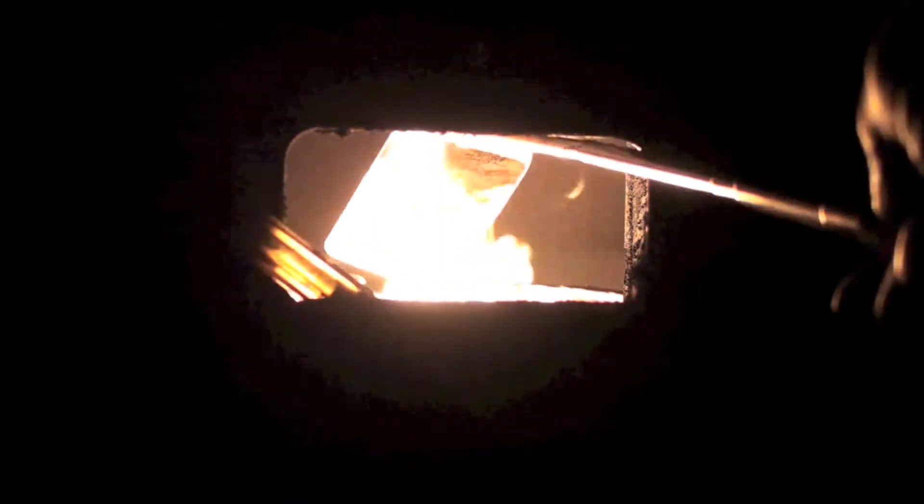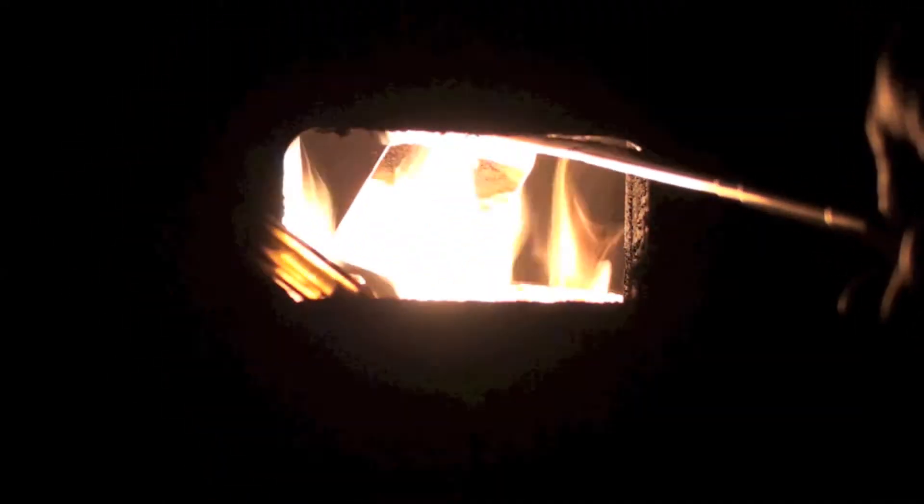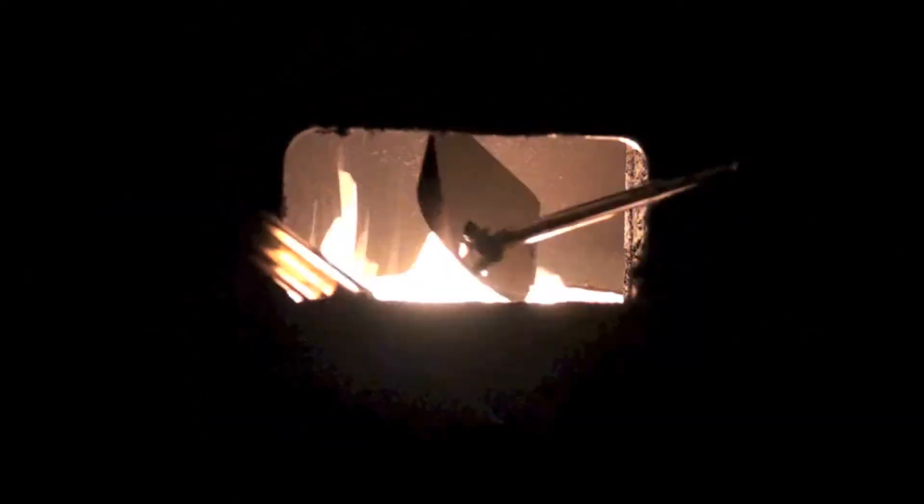When you're putting a flame mirror in like this, you're looking back and you can kind of see where the fire is coming from. Do not leave it in there more than about ten seconds — if you leave it in any longer than that, it'll turn red, and when you pull it out you can't see hardly anything out of it. It goes all dull, so you have to be careful.